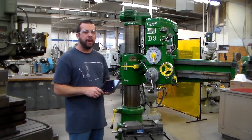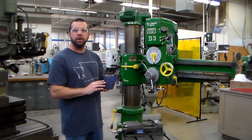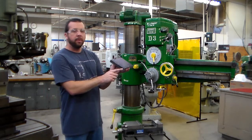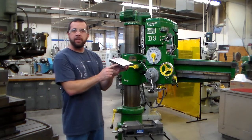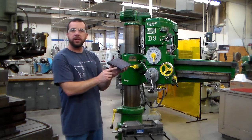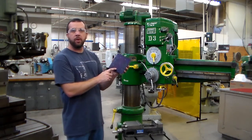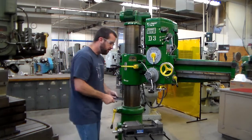So here we are, we're at the radial drill press. I'm about to put my part in the vise, and this is the last time I'm going to mention this. I'm going to make sure I'm clamping across the factory edges here because they're going to be more parallel than our saw cut surfaces. And I'm going to put the 6 o'clock hole on my side of the vise.